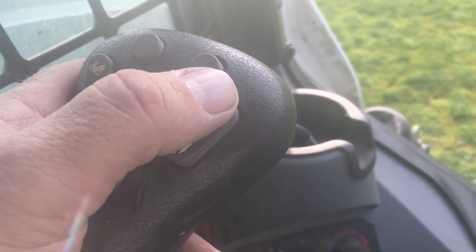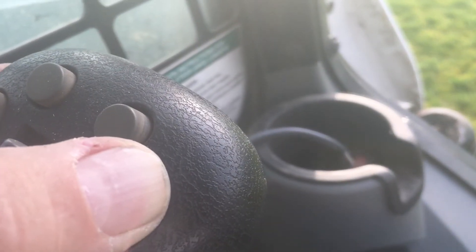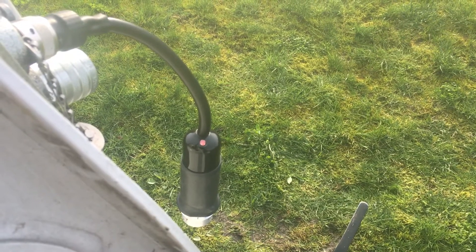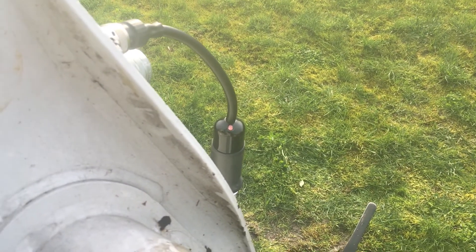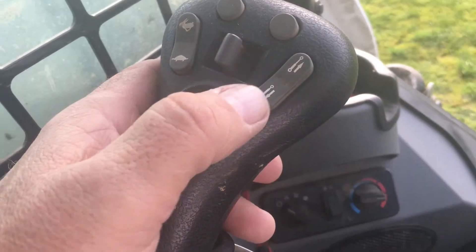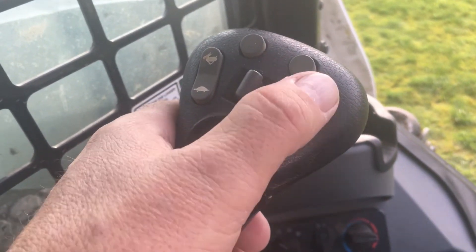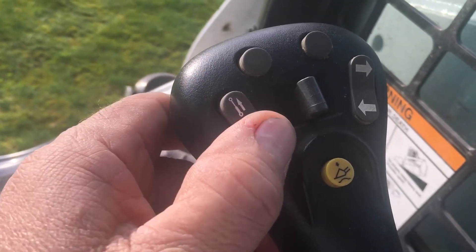If we look at the status indicator, we hold it down and hold it down, and all of a sudden the status indicator stays locked — now we're good to go. That's telling me I've actually locked that button in place: there's power going there and look — hands free, I don't have my hands on here anymore at all. So now I can go and actually operate other channels, and those channels won't lock on but they'll be momentary while this one's locked on. So I can use B2, come over to C1 and C2 and operate those buttons — they're completely unaffected by what's going on here.